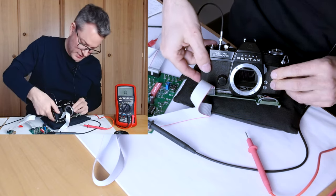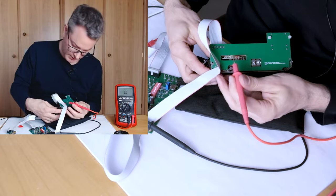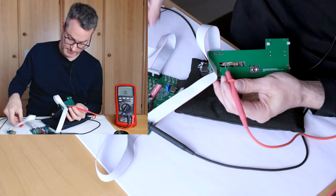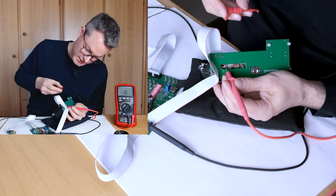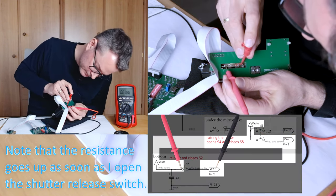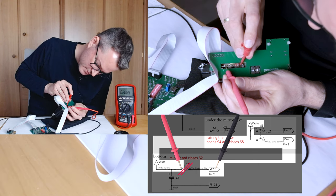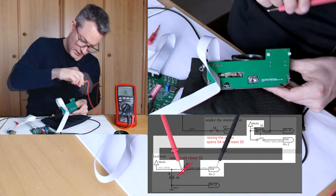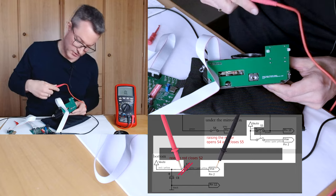I have verified that I can open the shutter release switch in this way. Now I will open the shutter in bulb mode and fix it in that position so the mirror is up. Now of course we have connectivity here just because the shutter release button is depressed, but we should have connectivity even when I open the shutter release switch — and indeed we have. So I have connectivity from the input of the shutter release switch, which in automatic mode is connected to the battery positive, to pin 2.